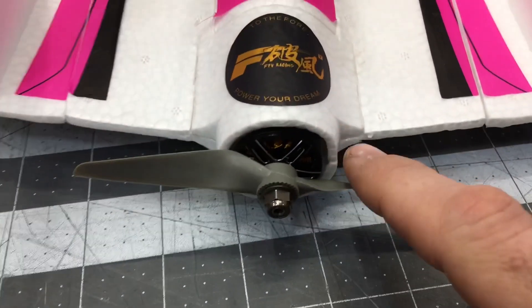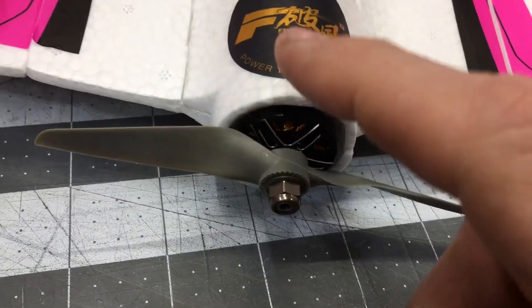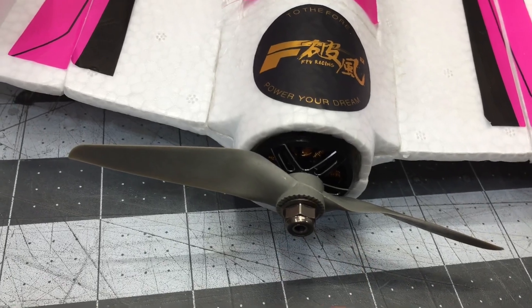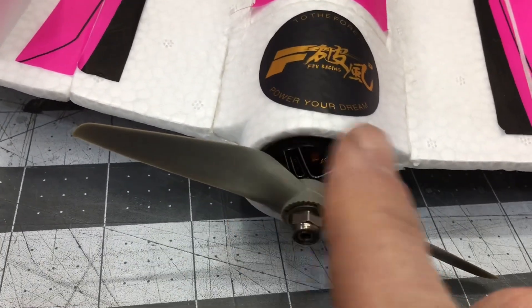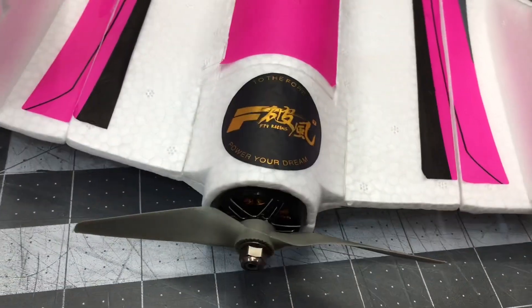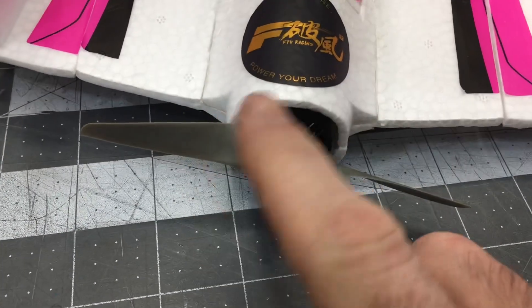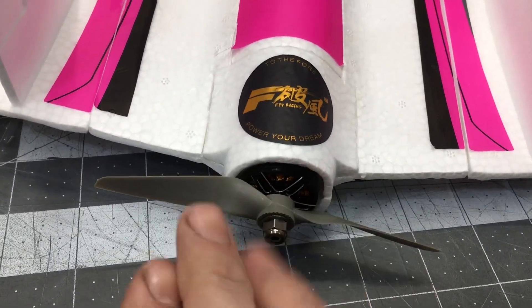So what I did was take a piece of 1/8-inch plywood and use a 1.5-inch hole saw to cut a hole in it. That fit perfectly — there's a little lip on the inside, and when you push it together, that 1.5-inch plywood piece I cut as a motor mount fit perfectly all the way around that little lip. I drilled, mounted the motor, and slotted the back of it. You can kind of see the plywood mount in there. I mounted the motor with the factory screws, put a washer on them — always make sure the screws don't stick too far through and touch the copper windings. Washer, Loctite, screwed the motor onto that 1.5-inch plywood motor mount, then CA'd it in place.